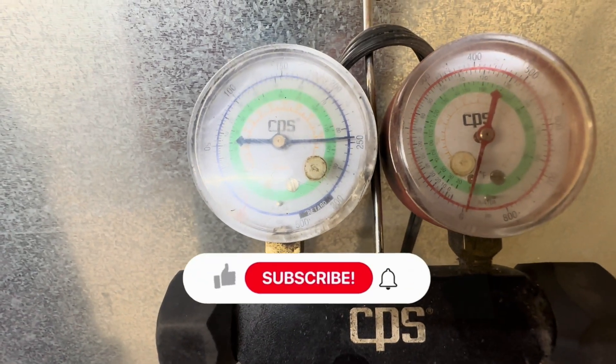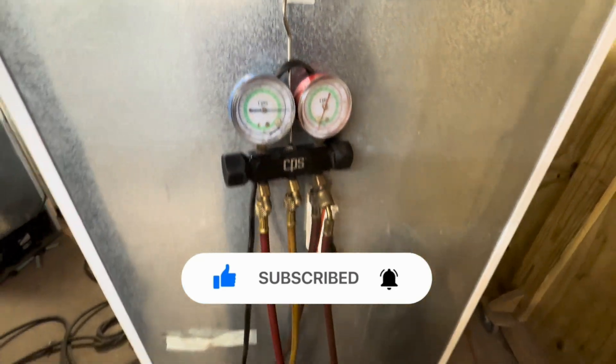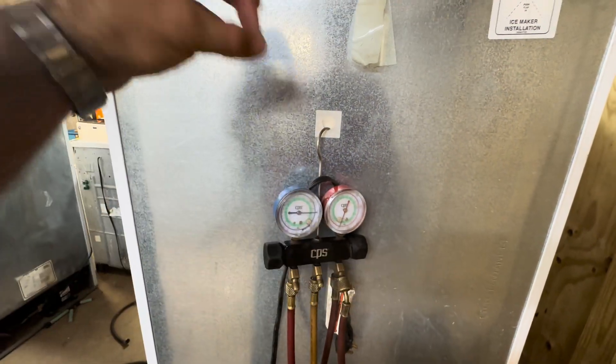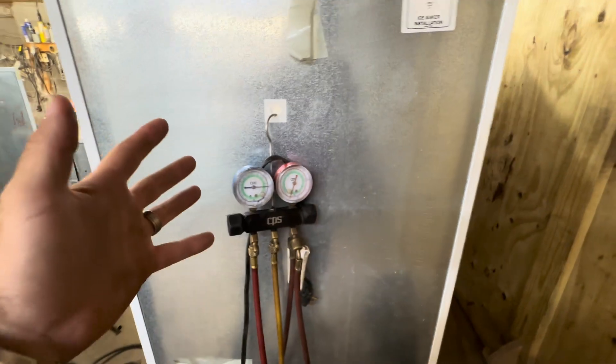We definitely have a leak still. The only place it can be is in the heat exchanger going up the wall — it could be right there at the wall, that's why we're getting an indication inside — or it's somewhere we just can't see the bubbles. So the leak detector found the leak but we can't see it with our eyes. She's a no-fix. I wish I could get my eyes on it — if I could find the bubbles we could JB Weld it and redneck-fix it — but this evaporator kit is $300. You just can't fix them. Stinks. Can't win them all.